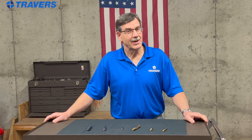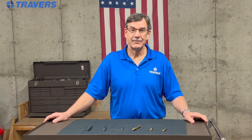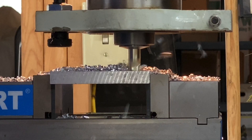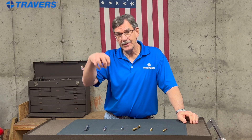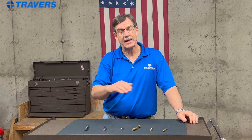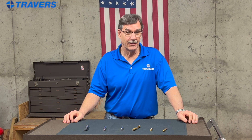If you're having a problem with your end mill chattering, you might want to look into a variable helix end mill. If you're machining a pocket in a workpiece and you're plunging the end mill in, or even ramping it down at an angle, you have to use a center cutting end mill — otherwise it's going nowhere.